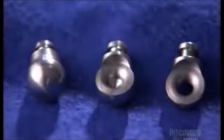Next, they load steel rods into a slowly revolving device. It moves the rods through a series of cutters. This is how they make swivels for the handcuffs. They round the tips of the rods and then carve necks below. This tool slices the swivel to the proper length. And then the partially finished swivel falls into a basket. Next, a drill works on the rounded tip, scooping out the center. And now you have a finished swivel.